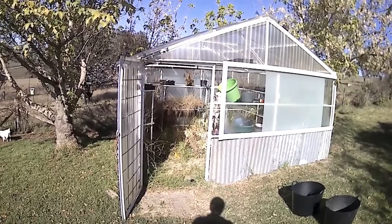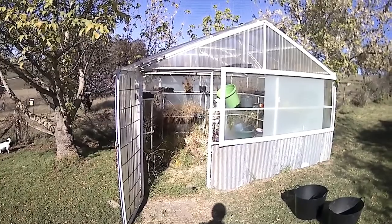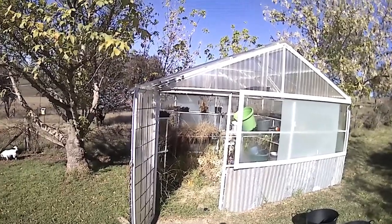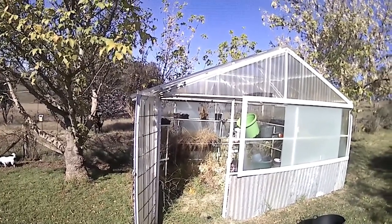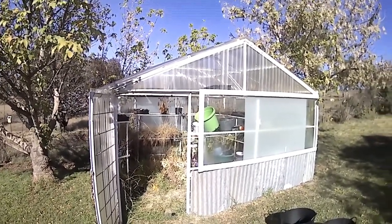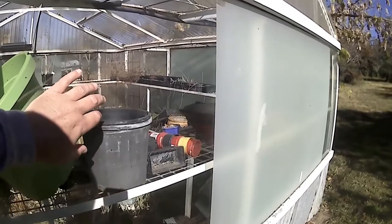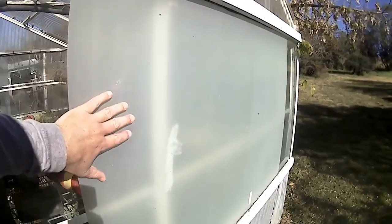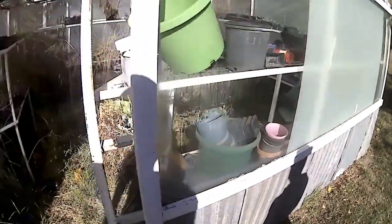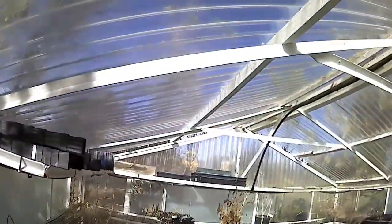It's a glass house that I've made from scrap materials from the local scrapyard. It's basically a frame of star pickets which are all welded together, with some timber screwed on here and there through the holes in the star picket. The glass is actually office partitions from an office building that was demolished. In total I've spent about five to six hundred dollars on it. The top part you can usually see through, and there's your privacy screen that's usually down the bottom — so it's all recycled glass and recycled tin.